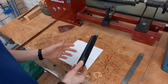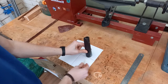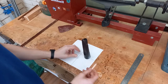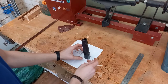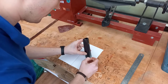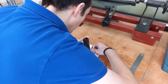But I'll show you the easiest and cheapest way of doing it without using ink or switching on a computer. Okay, so I've got my vacuum nozzle, and what we want to do, we don't want it too far up into the jigsaw puzzle piece, otherwise it'll only be held on by a tiny piece of wood. And we don't want it too far down, otherwise it won't be a jigsaw puzzle at all, it'll just slot together and slide out easily. So we're going to find a halfway point, which is about there, and then just slide it up so that the jigsaw puzzle can slot on the inside without being pulled out accidentally.